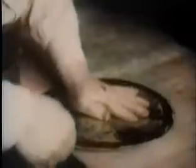The silver film acting as an electrical conductor, the disc now goes into an electroplating bath. As the electric current passes through the copper solution, it transfers the metal from this plate, called the anode, to the surface of the disc. After several hours immersion, the copper coating becomes thick enough to handle. This new platter is now carefully stripped from the original recording, giving us a copper and silver reproduction which is known as the master record.